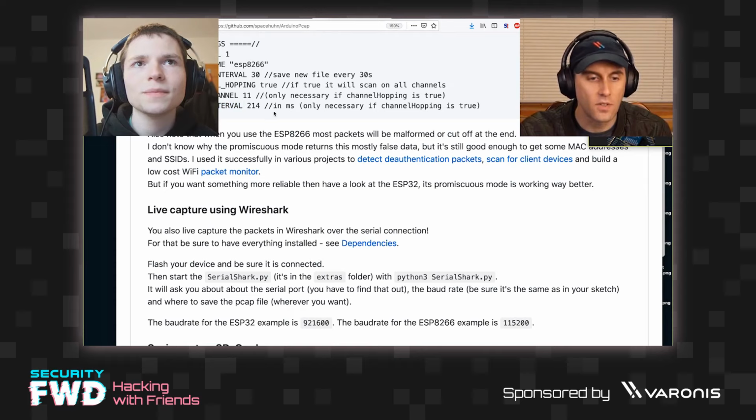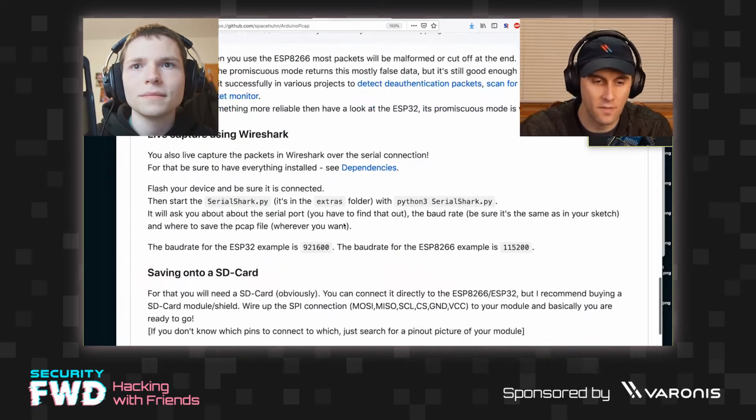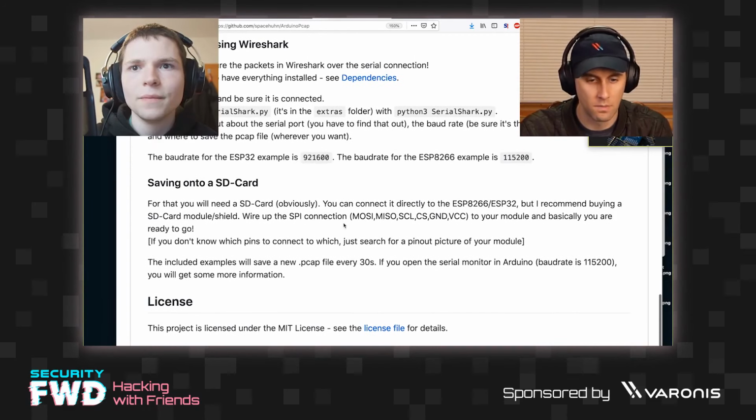Yep. And you can see also that you've very nicely given us the ability to change the hop interval. So if we are really concerned about that, we can make it longer or shorter to either be on a bunch of different channels all the time, or maybe spend a little bit more time on each channel to get a more representative count of the devices that are actually operating on that channel. Because we'll miss a lot of stuff if this interval is very short.